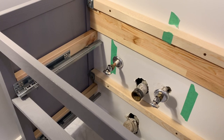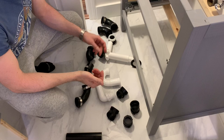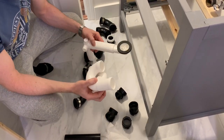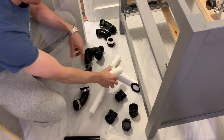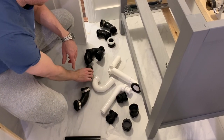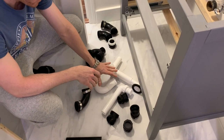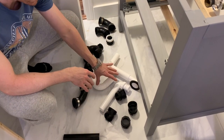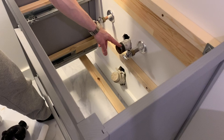The vanity is now mounted to the wall. For step two — the plumbing — IKEA sends their P-trap and other plumbing with the kit, but some of it isn't compatible with North American plumbing where the standard is one-and-a-half inch ABS. I like to dissect the kit and use as much ABS pipe as possible, using very little of their pipe.